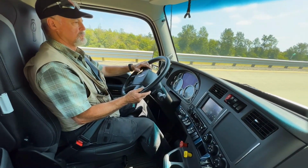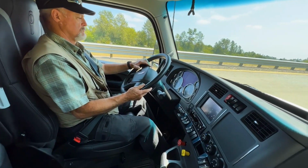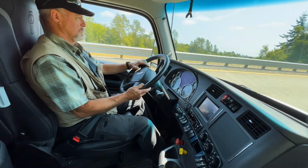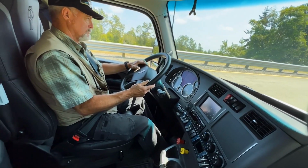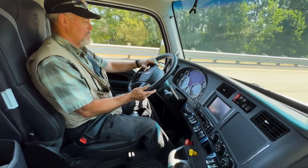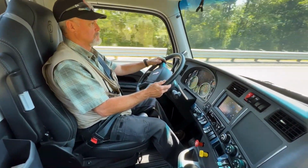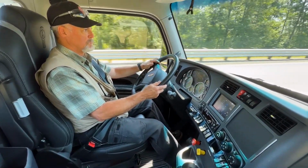Something to notice, you will see after you've charged your truck fully that those regen braking features are disabled, and an icon on the dash will indicate that. That's perfectly normal. It just means that there's no extra storage in the battery system for that energy that's being created when regen braking is activated.